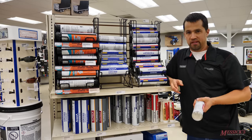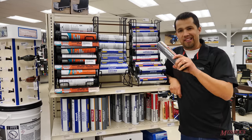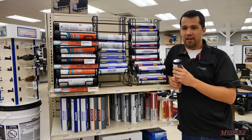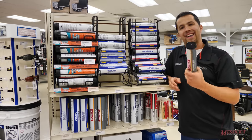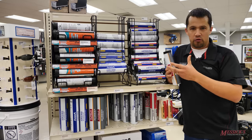Your entry level or most basic grease that you'll find is often called moly or moly lithium grease. This is a fairly inexpensive grease that's really best suited for things like moving joints — think your loader and backhoe pins and those kinds of things. Moly grease is not a high temperature grease; it's just a good quality grease that's made for those moving joints.